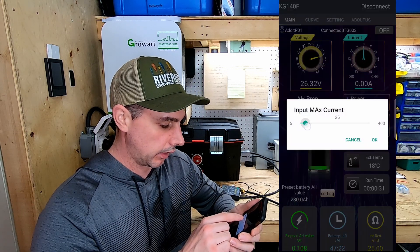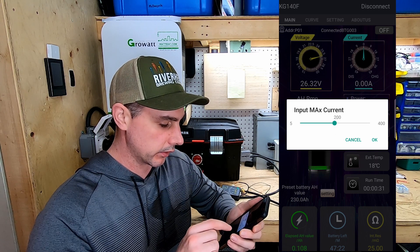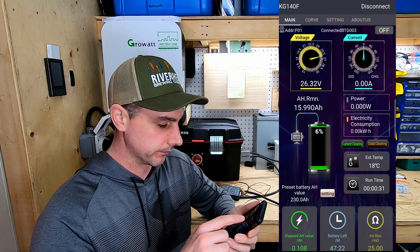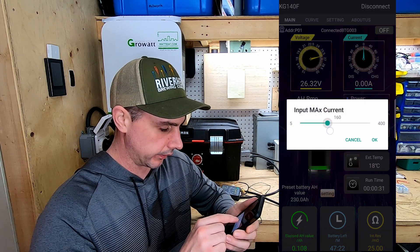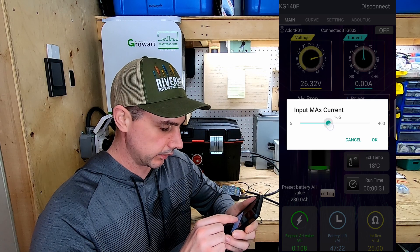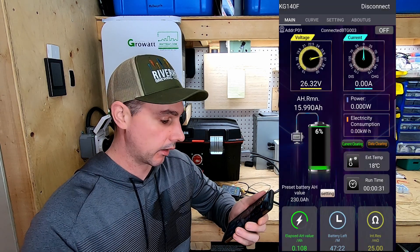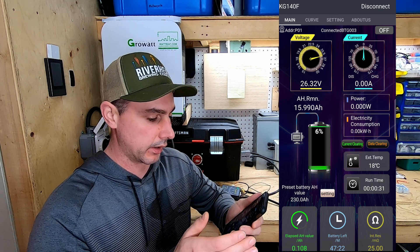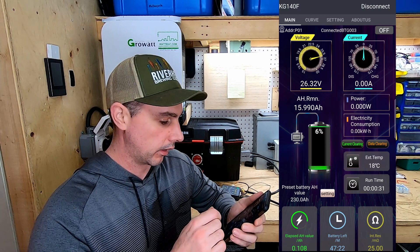Your amperage — I'm never going to go higher than 200 amps, so I'm going to change that to give me a much tighter reading. Let's go with 150... 175. So now you can see I have my zero and on one side it's showing me the charge and on the other side is showing me the discharge current.